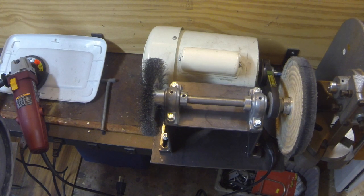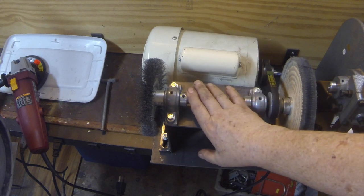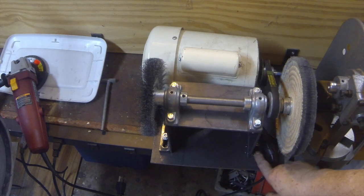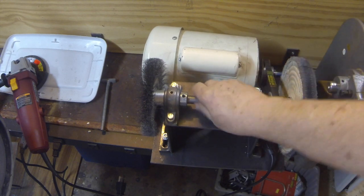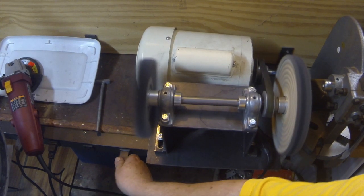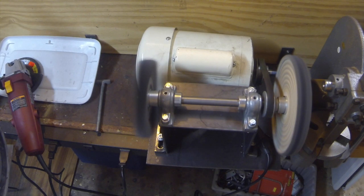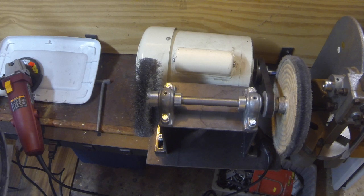Okay, here's the finished machine. I've got the uprights welded up, the mandrel mounted to it. I welded on a couple of one inch by half inch bars down here and slotted them so you can adjust it out to put the belt on and properly tension it. We'll fire it up here and show you how it runs. I don't have it on a switch yet, but I'll take care of that later on. But it's usable — I've got a wire wheel and a buffing wheel and it works pretty good, so I'm happy with it. Any comments, I appreciate it. Thanks for watching.